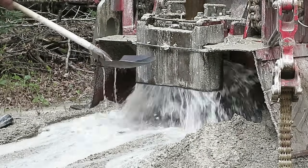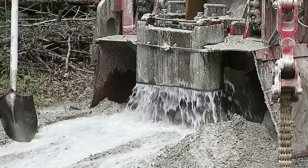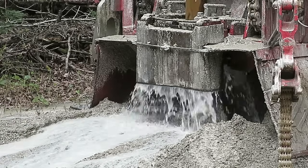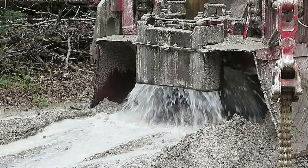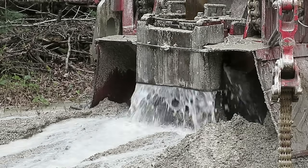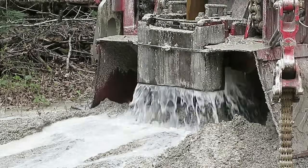We're just finishing up the last 20-foot long rod and then we're going to call it a day. As it turns out, the well ended up being 146 feet deep. We're looking forward to lots of great water. I know from measuring that the water rose to about 13 feet below the surface of the ground, which is nice and close — so it makes for easy pumping.